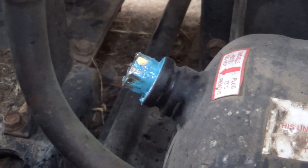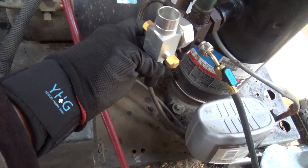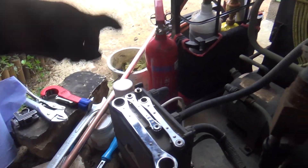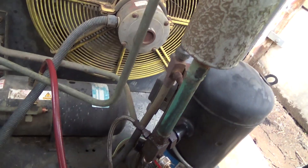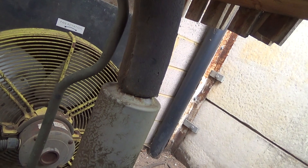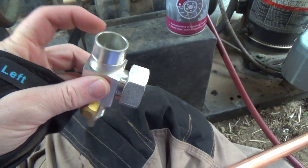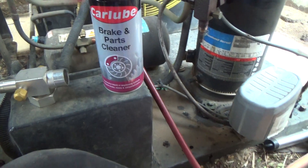OK, that's a new plug. Right, luckily we've got one on the van. That's all about bits and pieces - it's got a gasket, and you dry all the flux and stuff. I might just braze a stub of piping, and then we can stick it up here and just cut it off. That sets quite close to that, so we might have to put a little bit of a kink on it. And then we've got that dryer to change. These valves always have some oil on them from the factory, so you need to clean that off before you use silver solder or braze onto it - use something like a paper towel, give it a wipe round.